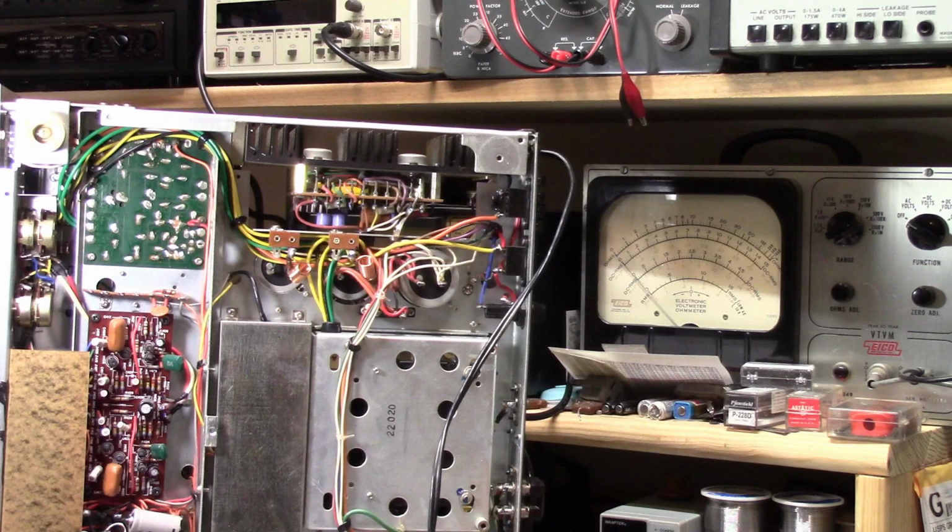Now, I know that because these capacitors are as old as they are, there's always that risk of failure. If I measure an electrolytic and the ESR is really healthy and the value of the capacitor reads where it's supposed to, I am inclined to leave them alone. Now, there are others who believe that you really should just replace them all, and I don't have an argument with that, but I am not so inclined to do that.